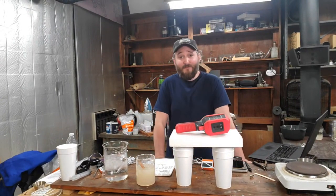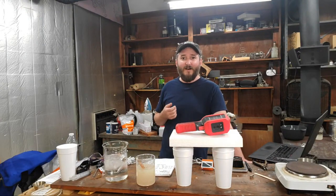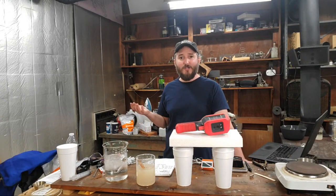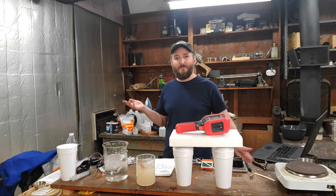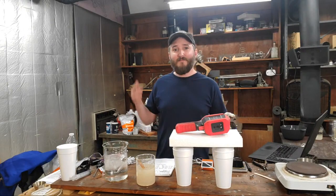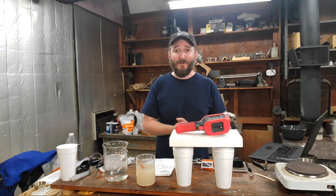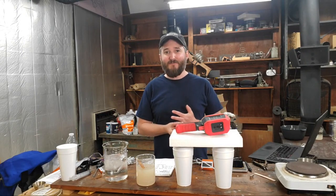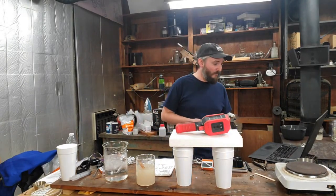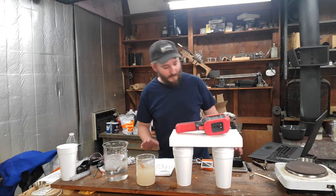But yeah, even if not, I painted my workshop roof last summer with an ultra white paint, not a radiative cooling sub-ambient temperature paint, but it has kept my workshop just below ambient temperature during the daytime just because it cools off so much at night. And then the white coating helps it not warm up so quickly. So right now it's getting warm in my workshop, but it's still probably 5 or 10 degrees Celsius colder than it is outside. So those paints are extremely useful.